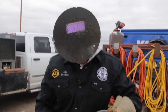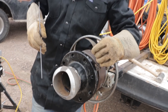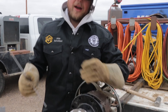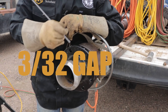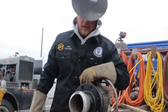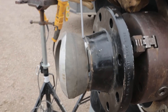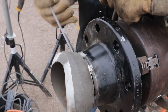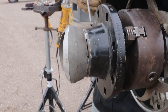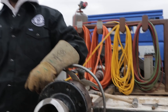We got this thing chucked up in the rollout wheel. The way I weld things depends on what size of pipe we're welding and how thick. This pipe is schedule 40, so I run about a 3/32 gap with an eighth inch 5P Plus root. I tacked it up in four spots so it doesn't move around on us. We're gonna start right here in the keyholes, run down it, and adjust as we go depending on what the rod's doing.